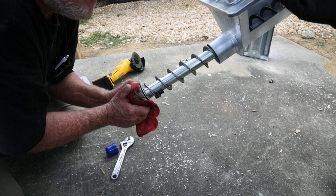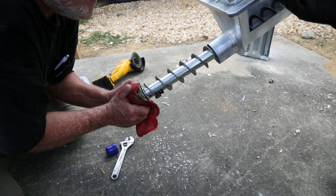Once confirmed, apply anti-seize lubricant to the bearing flange for future ease of maintenance. Carefully remove the locking pliers, then stretch the auger and release it so it snaps securely into place. Secure it with an anchor bearing clamp.